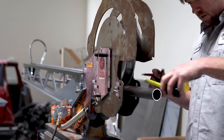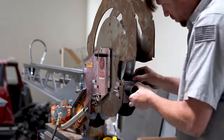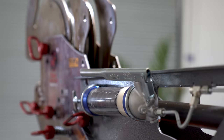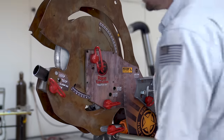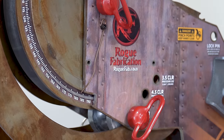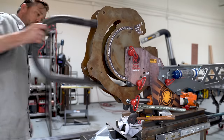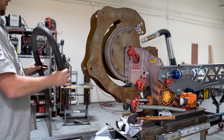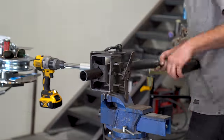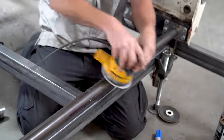But there's a lot I don't necessarily need it for, and that's where I got a little old-school. The drive shaft loop is the first example — it's just a 180-degree bend. I did some quick math in my head, figured out the material length, chucked it into the bender, bent it — beautiful profile once I got the mandrel dialed in — then notched it on my Rogue Fab Versa Notcher.